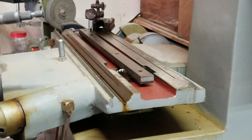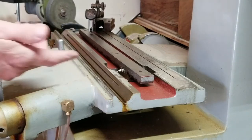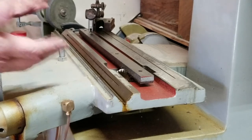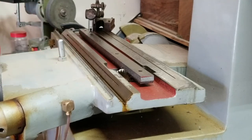Two hundred and seventy-one. No wonder — some gears are just banging against the gear rack, it's not meshing at all. Well, I see what's going to have to happen: we're going to have to shim that gear rack up. Wow. China.